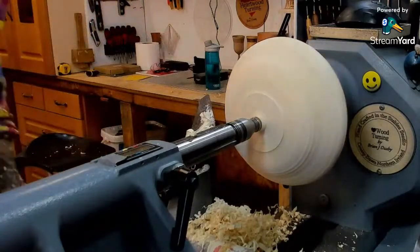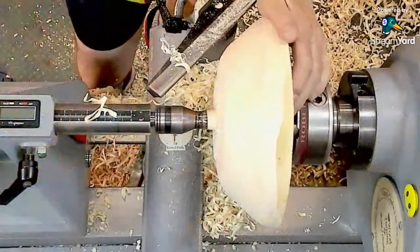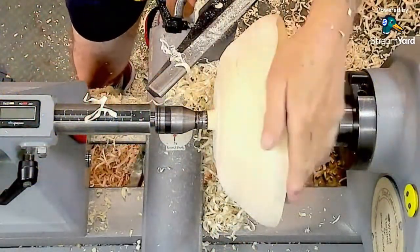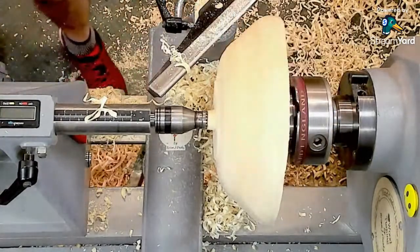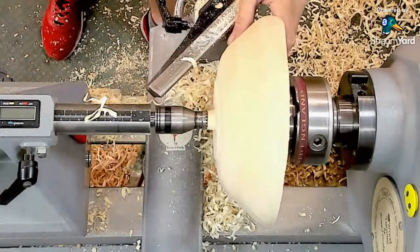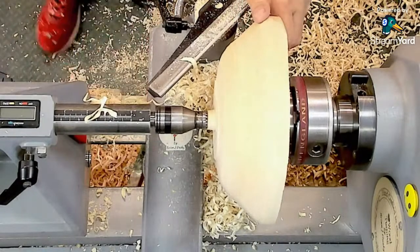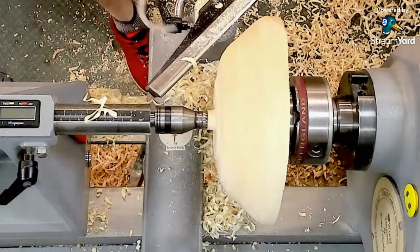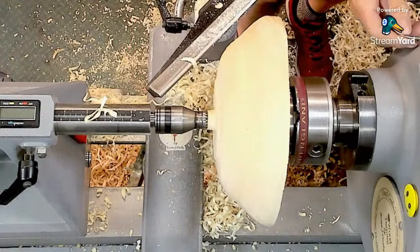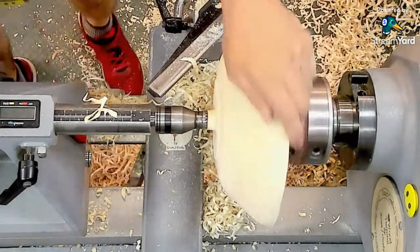So now we've got that into some sort of rough shape. Let's have a look at the overhead there. There you go, kind of rough shape. We've got a bit of a flat here yet, a tiny little bit of flat there. Spirit level and pencil in. We'll get our pen in. Right, we need a tenon, so a 48mm tenon. Using this little guy, let's just check it is at 48mm. A little bit too big. Bring down a wee bit. That'll do. So that's ready to go.